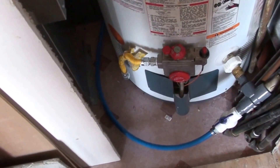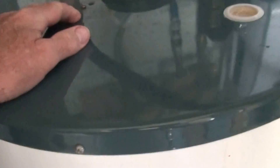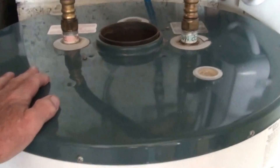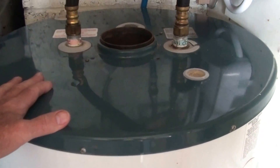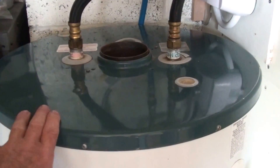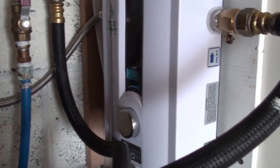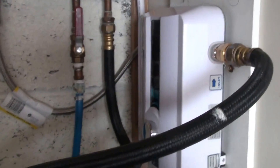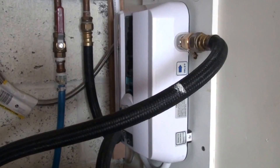I've got the gas disconnected and I'm using an old water tank — this is a 40-gallon gas water heater. Because I live in a house with a crawl space, my water heater is in the living area where the temperature is like 70 to 72 degrees. This particular model, the EcoSmart water heater, normally would need a 67-degree intake water temperature to operate the way they designed it.